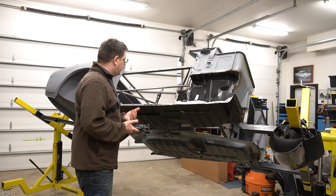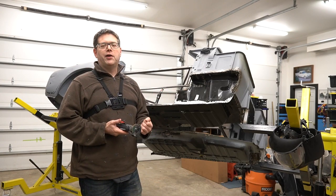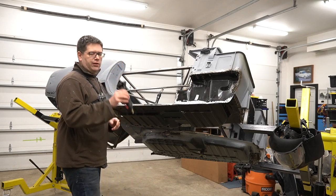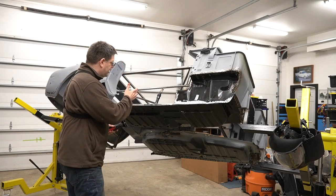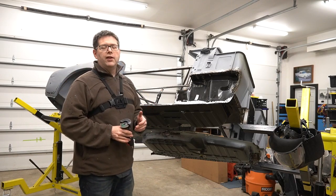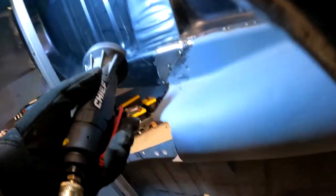So to cut in like that. And that by cutting in at an angle, you're basically putting two opposing beveled edges on those pieces. So when you go to sandwich them together, it really minimizes the gap and allows for easier weld penetration. So that's the concept. And the video is awesome that shows it.